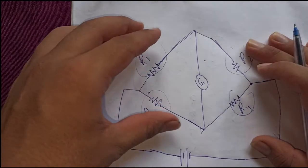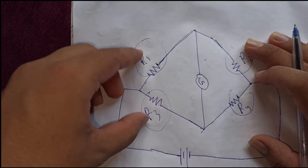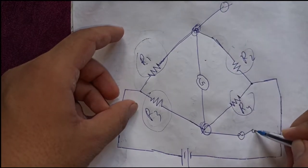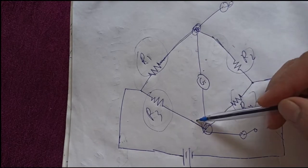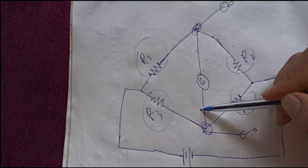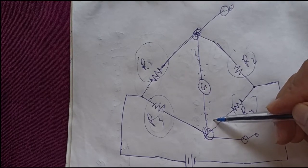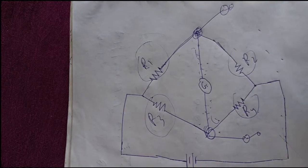If you press the load cell, the strain gauges apply pressure on them. It causes a change in the resistances. The change in the resistance gives a voltage difference across this terminal, and this is connected to the Arduino. The change in the output voltage is small, usually about 20 millivolt. This voltage is quite small, so it needs to be amplified. So we use an amplifier, HX711. This amplifier amplifies the small voltage signal up to 0 to 5 volt or 0 to 10 volt.